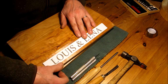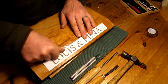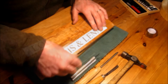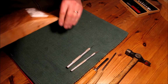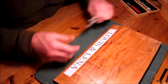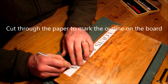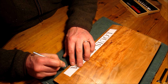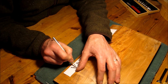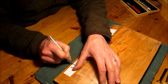So once you've lined it up and you've got the beginning and the end centered, you need to hold this down with sellotape while you knife the outline, and I'm going to turn it round so that I can see what I'm doing. And the first thing to do is to cut through the paper and score a line onto the wood. It doesn't have to be very deep, because all you're doing is tracing the outline of the letter for when you take the paper off and then you start carving along the line